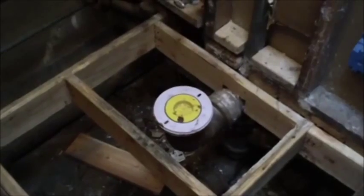But yeah, so that's a lot accomplished today. I'm very happy. There's not a bit of smell in this place. All that rotten wood has been removed. I have a few more spots I didn't get to underneath of that. Clean that out real good with a chisel and set some new wood under there. But she's strong, boys. She is really strong, and is going to make a super supportive base for the shower. So it's coming along good, renovating the Casa bathroom.